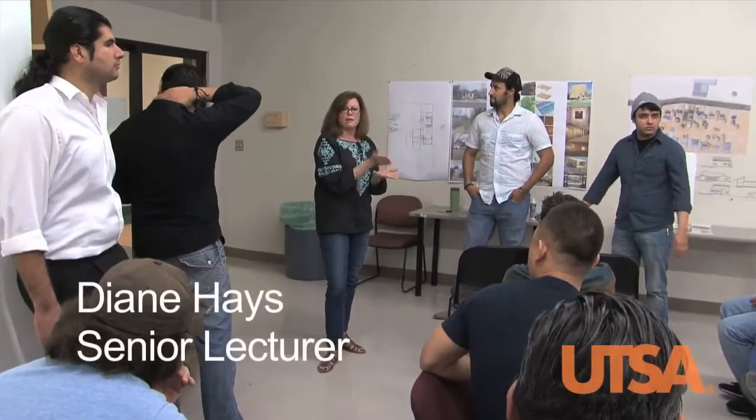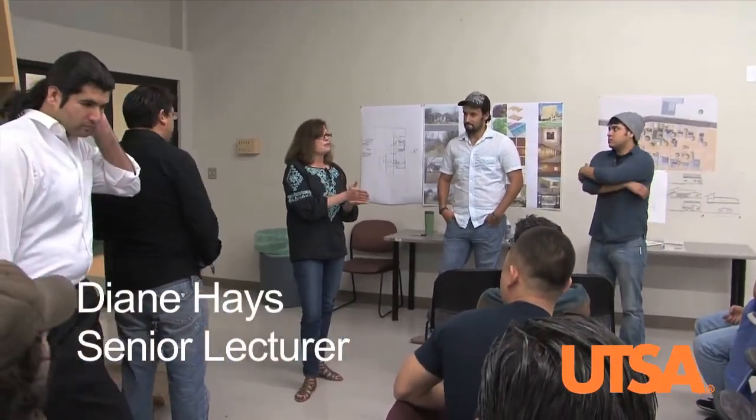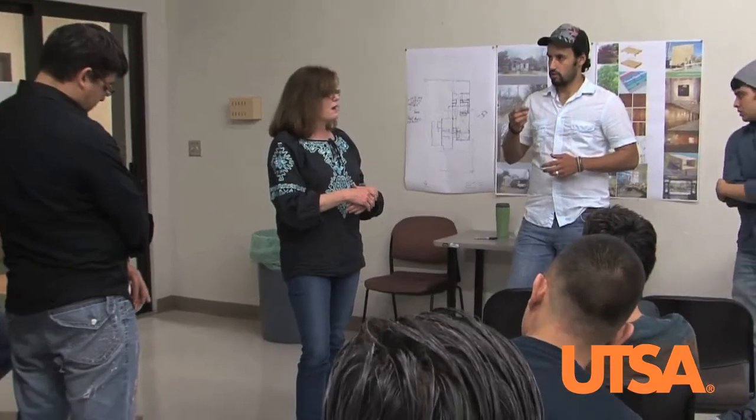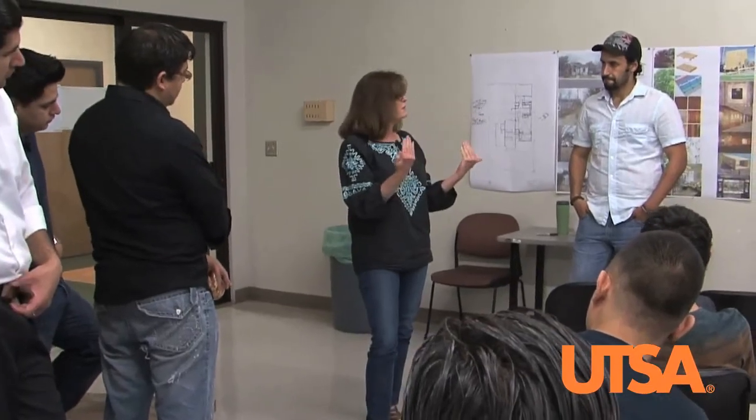We also need to talk about a date to finish the construction. I heard from the engineer finally about how we have to stabilize our wall. The 3x3 piece is going to be a little unstable and won't rotate. So we're going to have to get some of those metal fixing posts that are kind of T-shaped to anchor to the ground. Yes, the steel green ones. The steel green and white, yeah. So we're going to have to position those and put them close to the building.